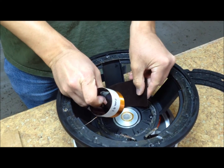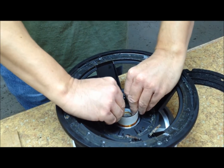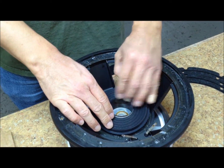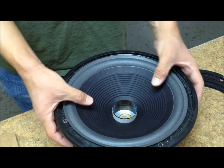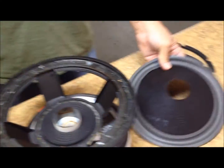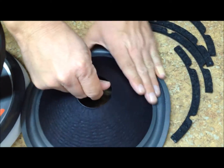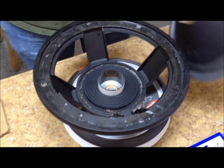Take your shim, clean off any debris that might have attached to it, put it in the gap, and evenly press the voice coil down into the gap. Dry fit all the remaining parts. If the cone throat is a little too snug around the voice coil, put it face down on the table and use the back of your thumb to gently open it a little bit or a lot if needed. Dry fit to confirm it fits smoothly.